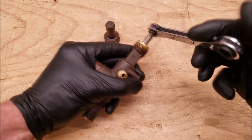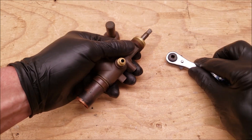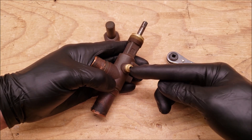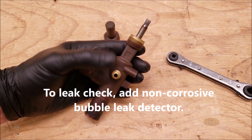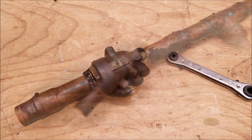So once again, counterclockwise all the way up and make sure it's tight before you disconnect your hose at the port. Then you leak check here, leak check here, to make sure that you're not leaking — that there's no bubbles forming or glistening, any type of movement of the refrigerant coming out of the system.